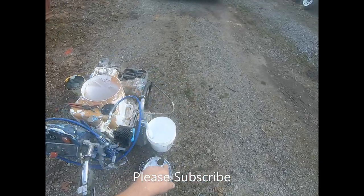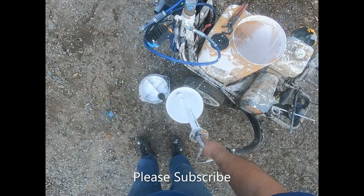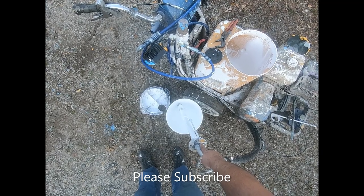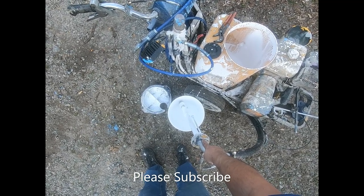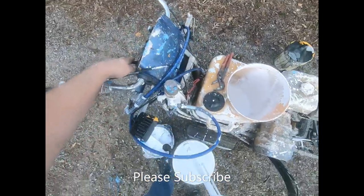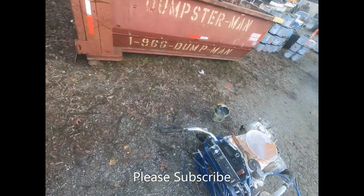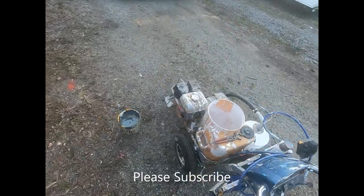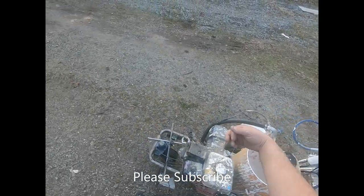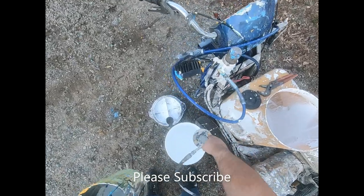What we're going to do is pull the suction tube out of the water, watch the primer tube, let it spurt a couple times. It's going to pop a couple times — that's all you have to do, then turn the pump off. The more you try to get the paint out of the pump, the more damage it's doing to the pump. So just pull it out, let it blow one or two little air bubbles out, and you're good. You're done with the cleaning.